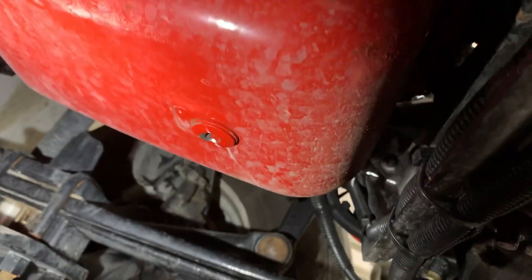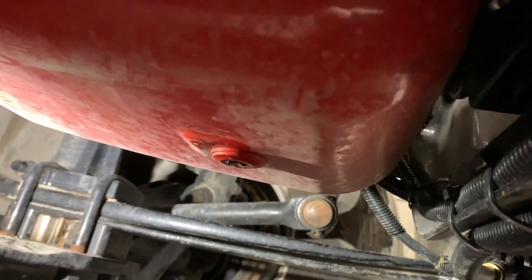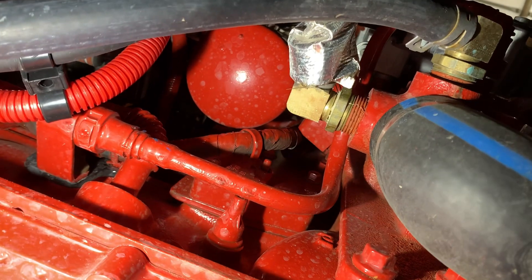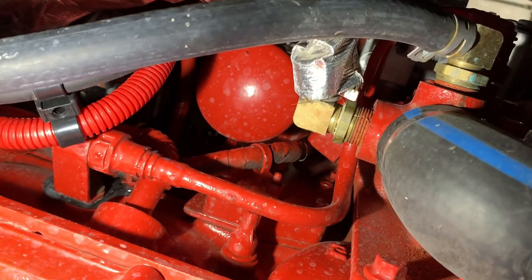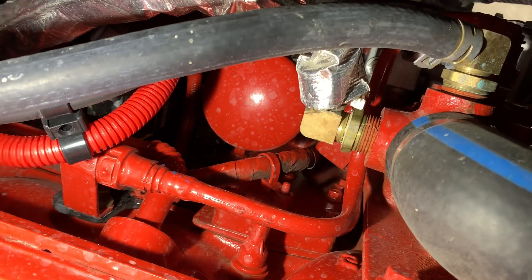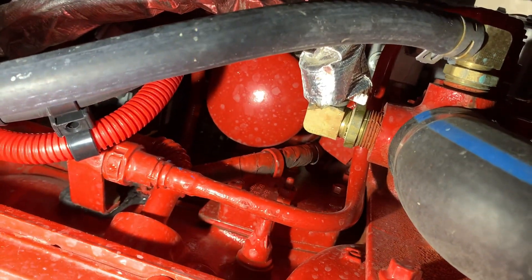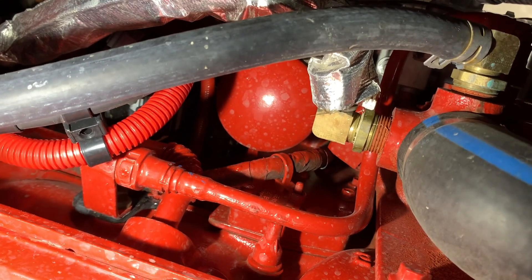Just like the other TMAs, with this engine I think you've got a plug. Yes, there's a plug on the side if you don't want to get everything out of the pan - or go to the bottom one to get everything. The other one's up about an inch off the bottom so you won't catch everything. Now that oil filter - that's where it's located. So if the truck is dirty, you better cap that filter before you go back. We still got to figure out - I went out the top because I took the air filter and all that off first. I didn't have that tool to try to get in there and get the filter out, so let's hope we can angle it down out of there.